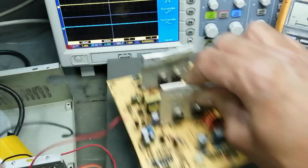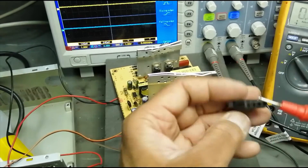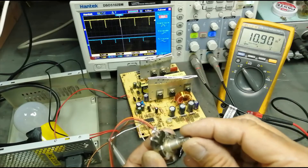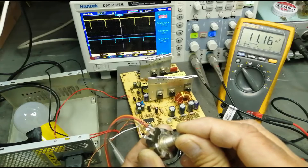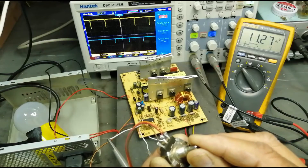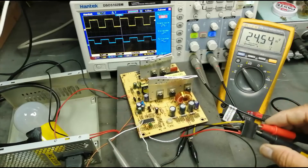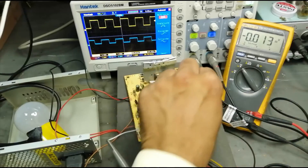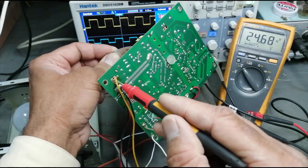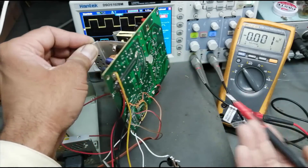Now let's start. Take care — disconnect pin number 16 very carefully. I will connect the multimeter and check the output of this ATX power supply transformer. You can check — it reads 10 volt. Slightly increasing because this potentiometer is 5k. I am increasing to 25 volt. The 12 volt section is now giving 25 volt, the 5 volt section is giving 10 volt, the 3.3 volt section is giving 6.8 volt — so we doubled the power.